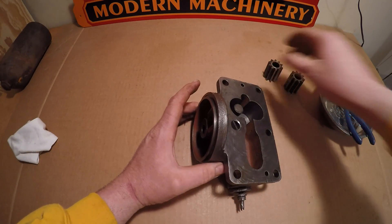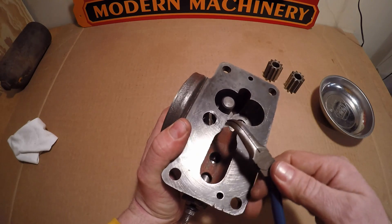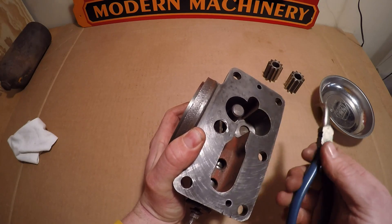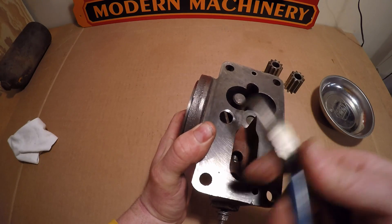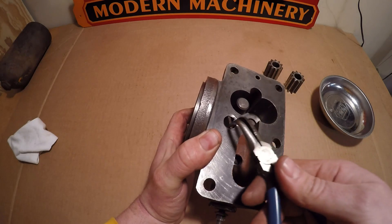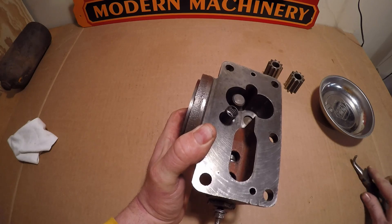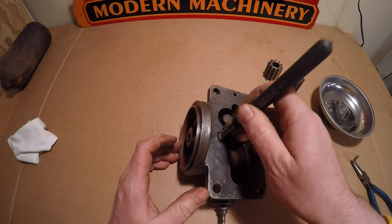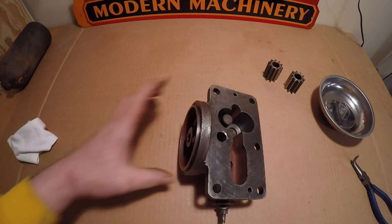When I cleaned this up and gave it the initial inspection, I found that the friction wedge that's supposed to hold the bypass check ball and spring into this bore was entirely too loose. This should take some pretty robust tools to get it to come out, but I found this one pretty much just comes right out on its own. So that is definitely something that needs to be addressed. I got the spring and the check ball out of there.